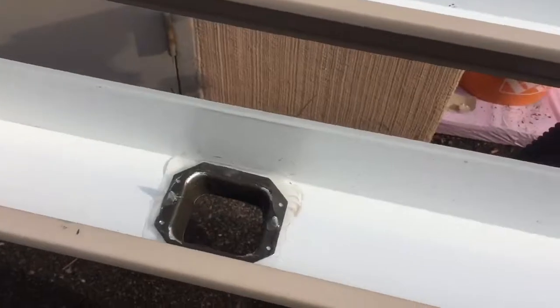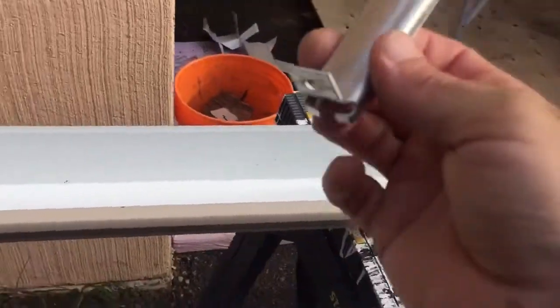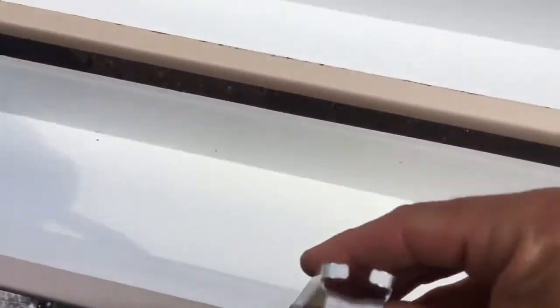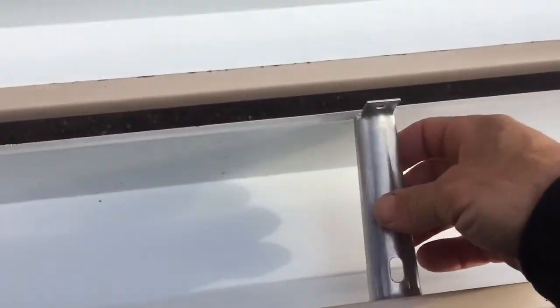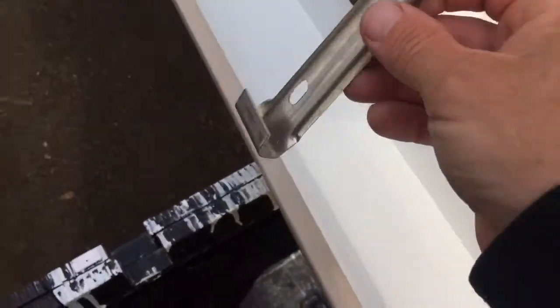All right, we got all our ends caulked. A little bit of sealant around the drops. Go size down, so we can do the hangers next. First time I ever did a trough, I tried to put these up as I went, so I put a couple in to start, and then after I got up there, I tried to feed them in. Well, don't do that. It's super hard, if not impossible. So you want to put all your hangers in before you even bring the trough up.